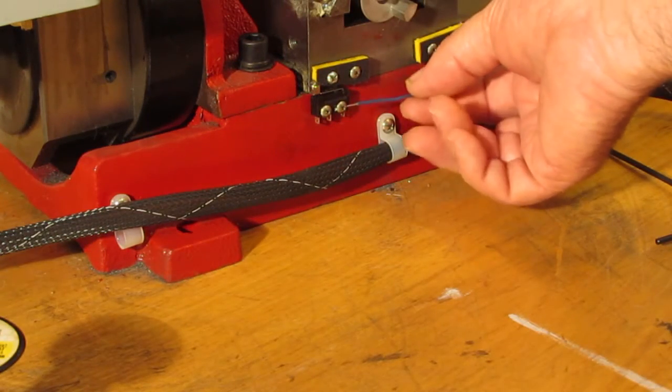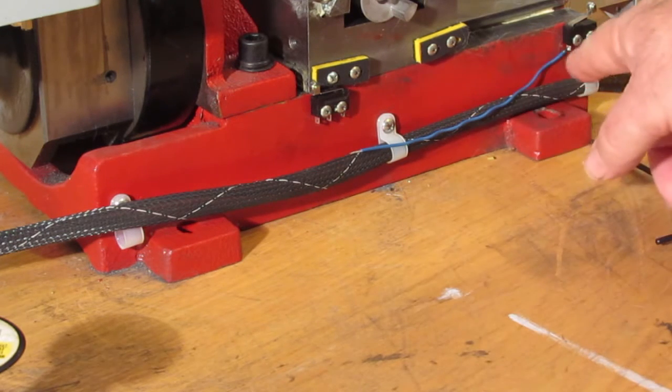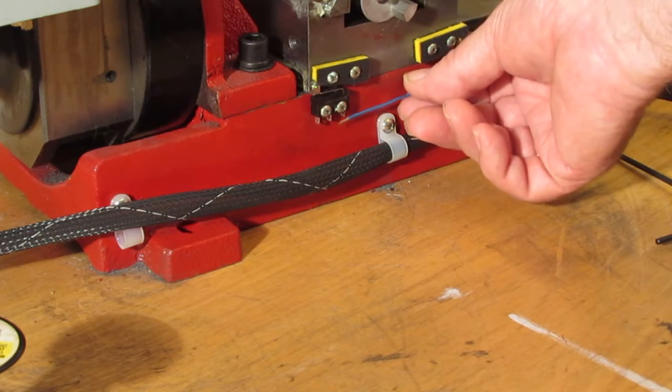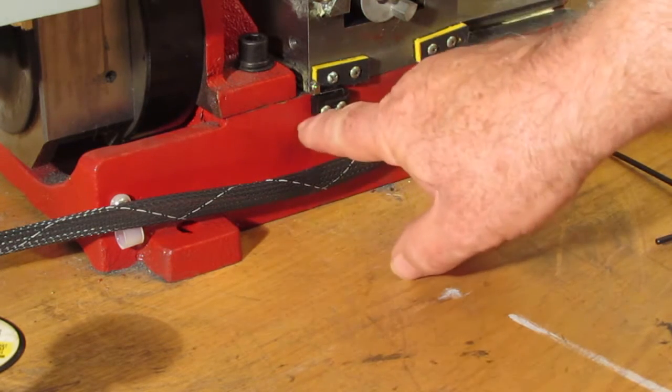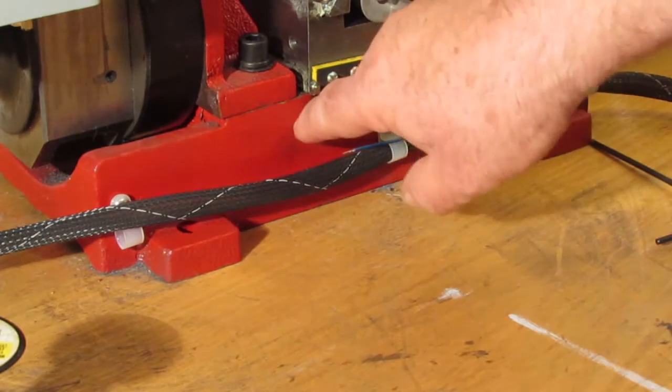Here's a schematic for those that understand schematics - the two switches are wired in series. If there was just one switch it would be like the Z-axis: the Z-axis signal goes through the switch straight to ground DC return, so that when the cam hits the switch the switch opens and the signal goes logic high. I've already got a wire on here and was about ready to wire it up. I need two wires - one DC return and one actual signal - going through the sleeving and into the box.